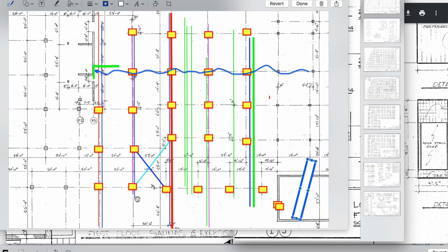The main bars. No one answered that in the previous video I did. What's the main bars? Well, the engineer states this is a two-direction or two-way slab, that if you press here, it's going to pull equally everywhere, not in one direction. It's going to be nice and uniform, sort of like this, as you load here. But wow, what happens when you get out to here, when the vehicles turn and they come, say, right there? So it's going to equally load. Let's just do this.